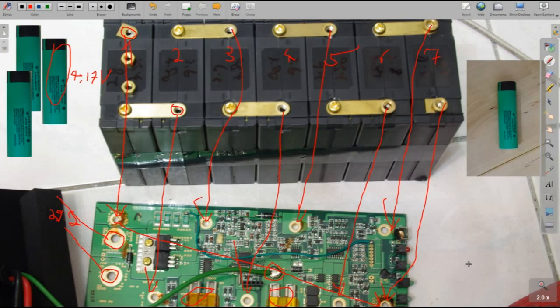My first intent was to use some cheap cells from China, nice blue color, and they stated to have 4,600 milliamps, and I thought, wow, then I can take 12 of those in line, adding up to 84, and I would have a battery with 55 ampere hours. The battery cells were very cheap, only like $3-4 each. However, it was a scam, and I only got maybe 1,200 milliamps out of each cell.